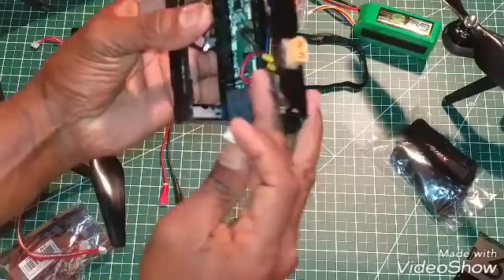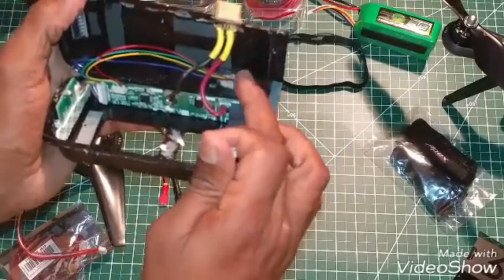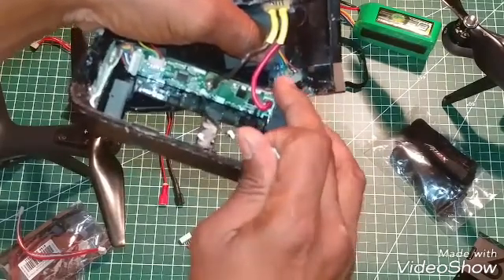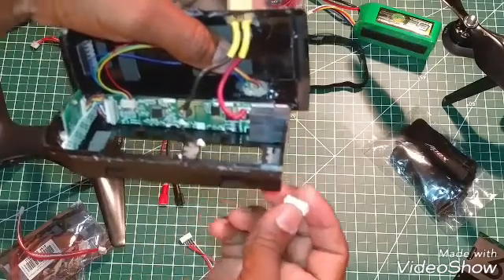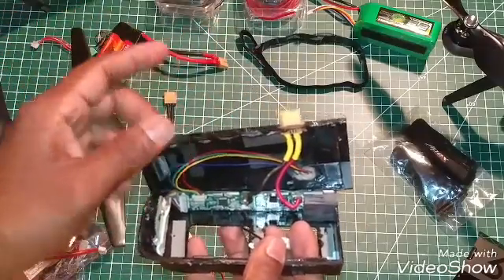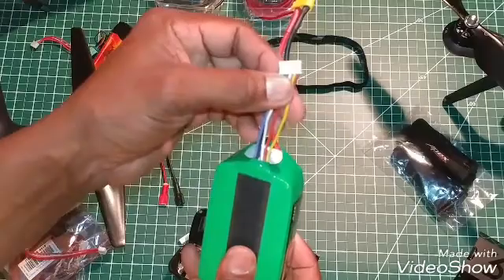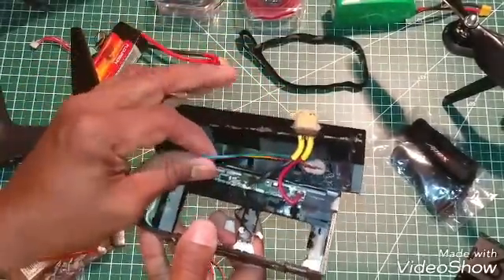The color pattern on the setup, going from right to left, is: red, black, yellow, green, and blue. That's the way I have this plug facing down — that is the direction. Now if you look at my other videos, you're going to know the actual setup for cell one, two, three, and four on this plug. You're going to know from the old Solo battery where the cells are located so you can make a proper connection. If you follow what I have here, you shouldn't go wrong.